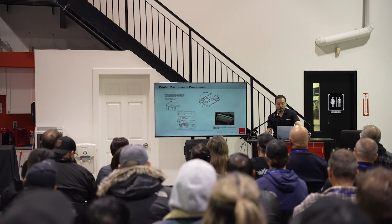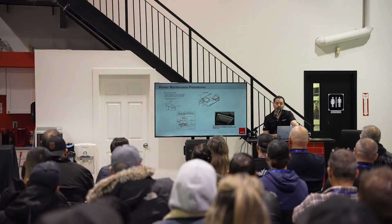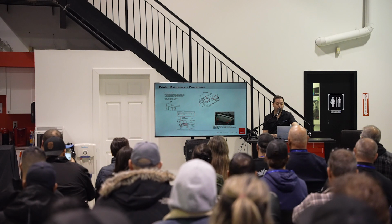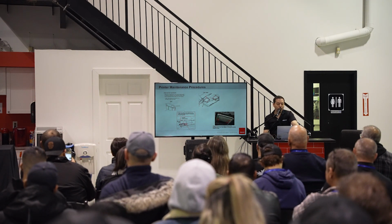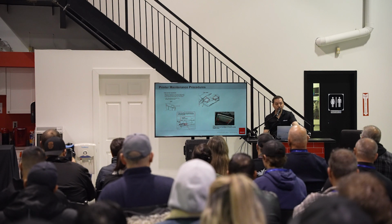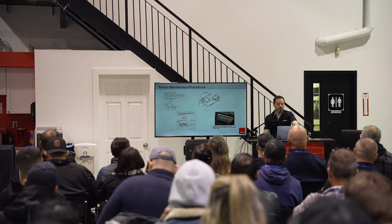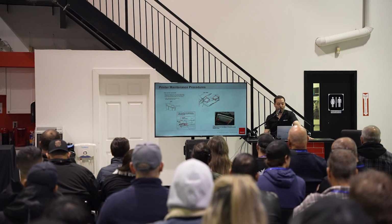So you can see in the first picture there, the wiper. So the machine does have a wiper for its automatic purging. So the machine will purge, and then a wiper will come and wipe that printhead from the ink that is sitting on it. So if you're not cleaning that wiper, essentially what you're doing is you're just wiping more ink back onto the printhead. So it's a little slide showing you how to clean that wiper.